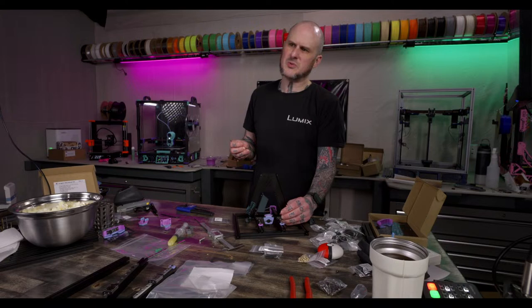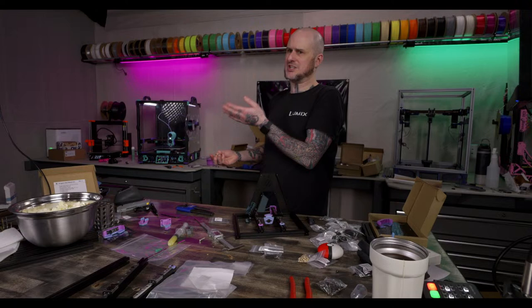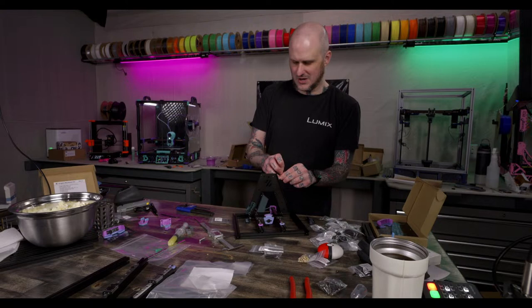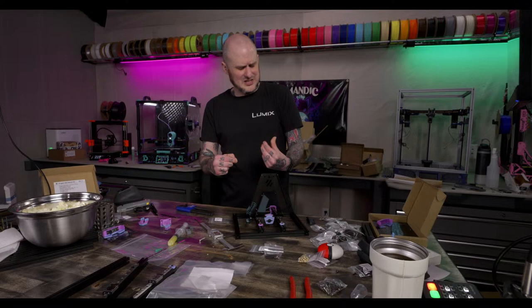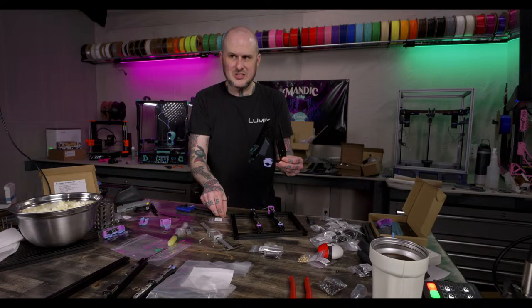And that's part of where my last email to Drop Effect was: were those people printing PLA or were they printing higher temp materials? I'm printing ASA, which is absolutely more forgiving of heat creep. Lotus, welcome! I'm printing ABS and ASA, which is way more forgiving of heat creep than PLA is. So, I could see saying the design of the Next G hot end, with its kinematic design, which allows for thermal expansion of the heater block and everything, really feels like it was always intended for engineering type materials, in my opinion.